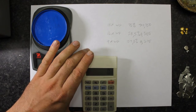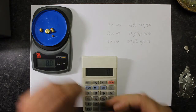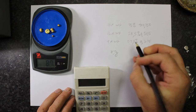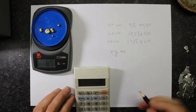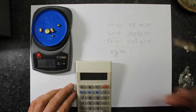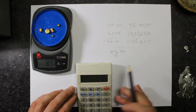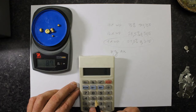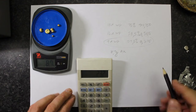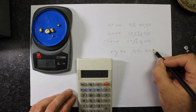Let's weigh our fine gold as a starting point. We've got a starting point of 8.7 grams of AU — the chemical symbol for gold — and we want to make 9 karat white gold. The next step is to work out the total weight once alloyed, so: 8.7 divided by 0.375, which gives us a total weight of 23.2 grams.